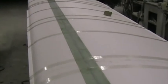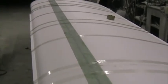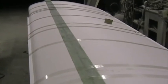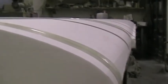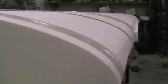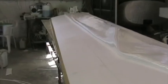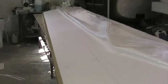And then once the wing skins are in place, you can then fill in the slight depression on the top. But if it's high, you would sand through the skins, which is not acceptable. Make sure that the leading edge is nice and straight, and the trailing edge, and everything is nicely in line before you leave this to set. We're now ready to skin the top surface of the wing.